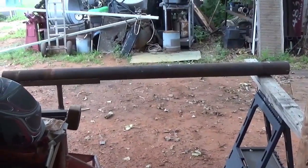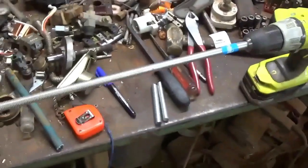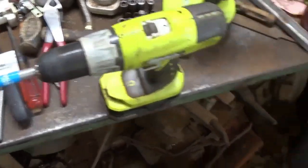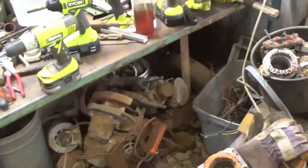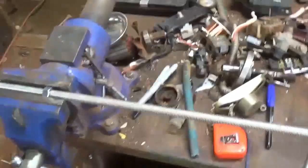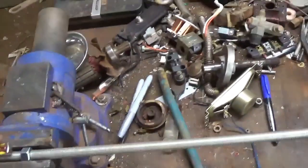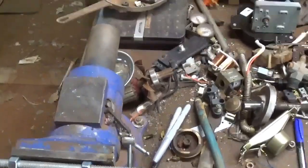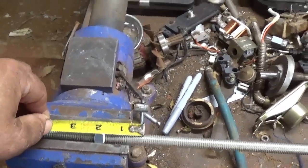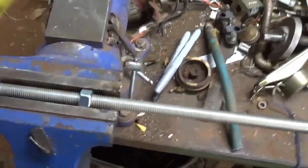The plan is to drill some holes, weld some nuts on there, and then I can put my new bolts in. I'm going to cut these down to maybe two inches. I think it'll work — it goes in a half inch, it'll still stick out an inch to an inch and a half. The nut itself is probably close to a half an inch.